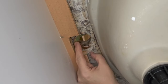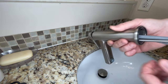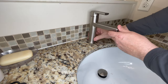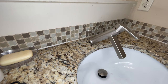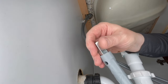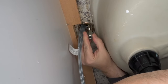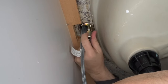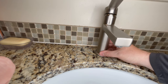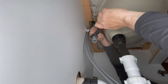Make sure your O-ring is in the bottom of this before you put it in place — that is what's going to seal into this single hole. Set it right down in there. This doesn't want to stand up at all, so you're gonna have to do a little adjusting. The nut that's going to secure this piece actually goes right inside — it's got its own tool, and these tools work really well. Put the washer and the nut on, get it started and secured, not super tight because you need to center this right. That's one of the reasons why it leaked before. Once you get that set up and you know it's straight, then we can go back down below and give it the final snug.